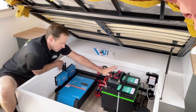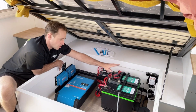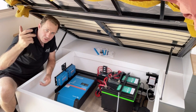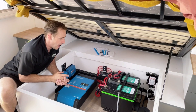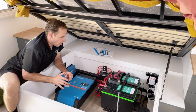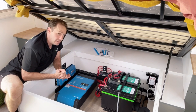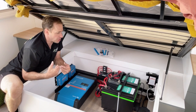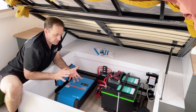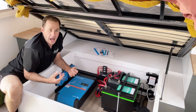I'm able to monitor the inverter, the DC charger, and all my solar controllers through this shunt. It will talk to the factory Odyssey screen or Trek screen, whichever one you've got. It's an external shunt. I'm not sold on them, and I'll tell you why - mainly from what it shows you up on the screen. It's very simple and it only shows you simple stuff, which is fine for most people, but I'm a bit of a tech and data head.